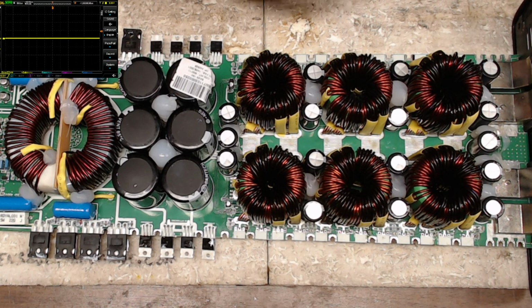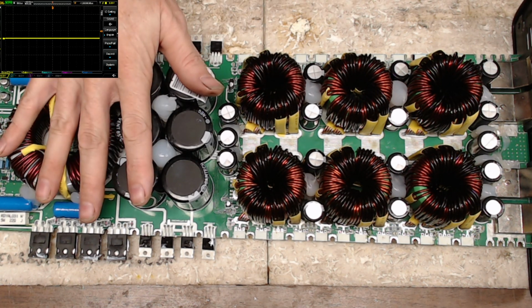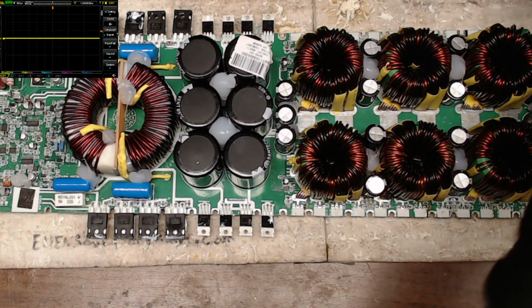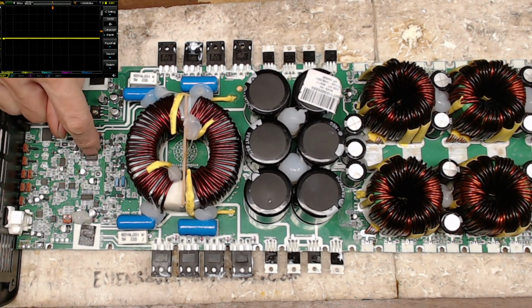So that tells me I'm good to go ahead and reinstall all my 4.7 ohm gate resistors across the board here. The drive ICs that I reinstalled are good. And what we'll do is get it all back together. I don't show any shorts on the output section, which is thumbs up. These use the GW80H65s. So these are the 80H65 output transistors, the 1404 power supply transistors. On the output side here, it uses the SI8244 drive ICs, 2 of them.